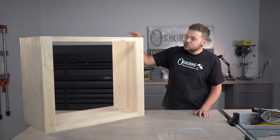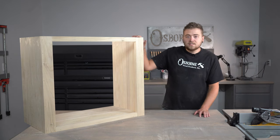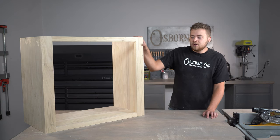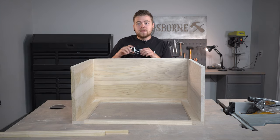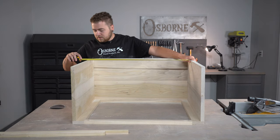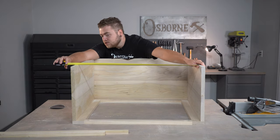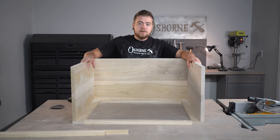The overall storage part of our cabinet is done and we've got our face frame installed — this is a really sturdy base for the rest of our project. The next thing is to get our interior shelves installed. We need to take measurements on the inside of our cabinet. We're going to have three shelves, so I'm going to check the width at each shelf location to make sure I'm getting an accurate measurement. We're right at 32 inches wide on the inside, which is what our shelf boards need to be cut to.